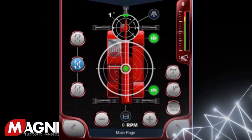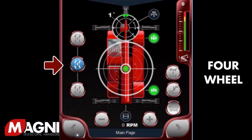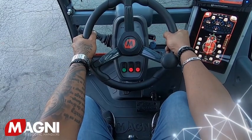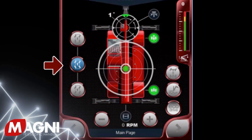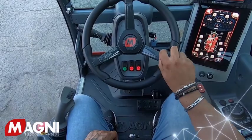On the left side of the machine picture, there are three buttons that allow you to select the type of steering. Starting from the top and working down: one, front two-wheel steering; two, all four-wheel steering; three, crab — all tires facing in the same direction. To change between steering modes, turn the wheel straight until the tire indicator turns green. Depress the brake pedal and push the desired steering function button, which will turn blue when activated. If the wheels are not straight, the desired steering function button will blink. To correct, simply turn the steering wheel slowly to straighten the wheels and the steering function will engage.